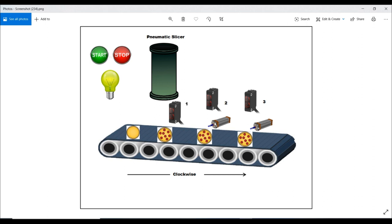At station two, the camera vision sensor detects the spreadability of the pepperoni on the pizza. If the pizza does not fulfill the qualification, the pneumatic cylinder will push the pizza out from the conveyor. Before the pizza is packed, the weight must be checked using the load cell sensor to ensure it complies with the required weight. If it does not, the rejected pizza will be pushed out by the second pneumatic cylinder.